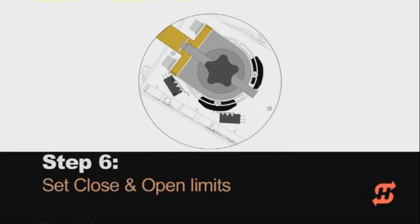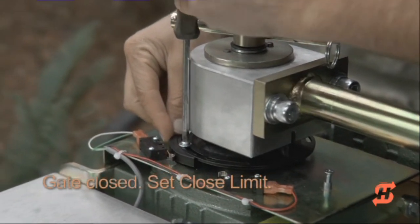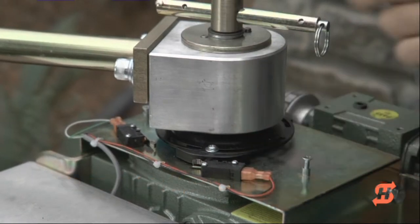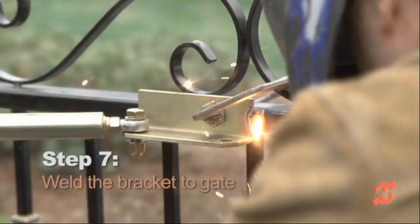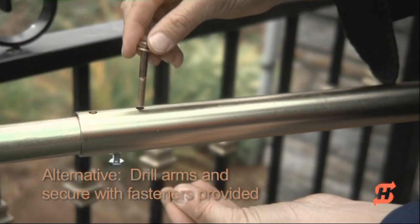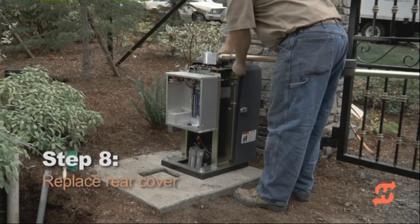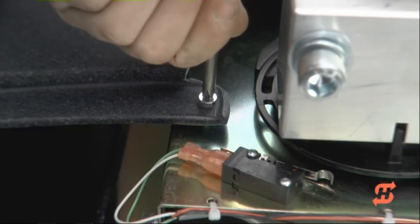With the arm assembly and elbow covers in place, it is time to set the close and open limit switches. With the gate closed, set the limit cam to trip the limit switch in the gate closed position. Manually open the gate to set the other limit cam to trip the open limit switch. After manually testing that both the close and open limit switches trip, secure the gate bracket and arm positions by welding an eighth-inch fillet. An alternative to welding is to drill holes through the long and short linkage arms and secure them with the fasteners provided. Remove the two Phillips-head screws and wingnuts stored on the chassis. Place the rear cover over the bottom plate studs and align with the screw holes on top, then re-secure the rear cover with its fasteners.